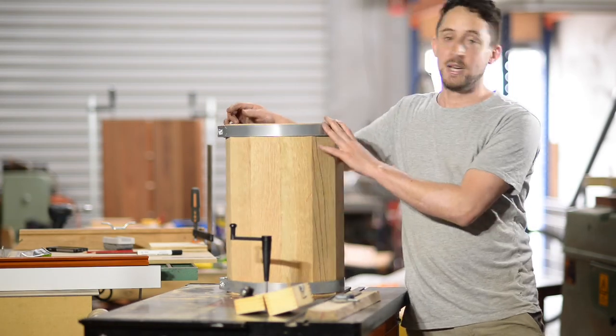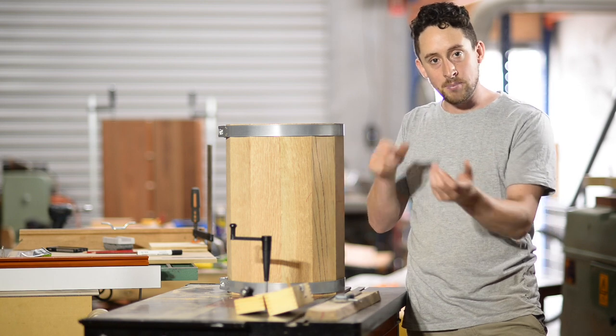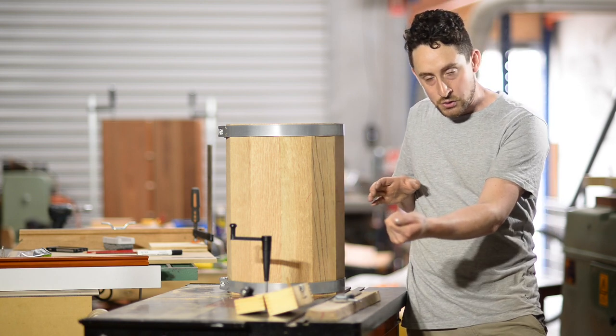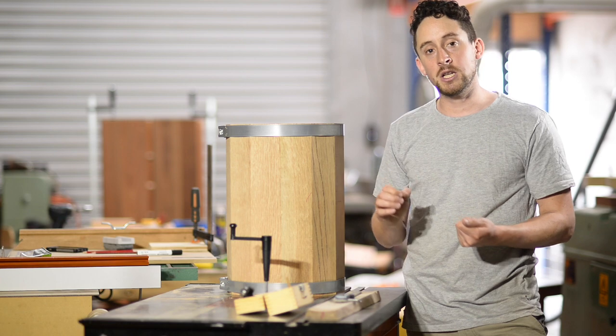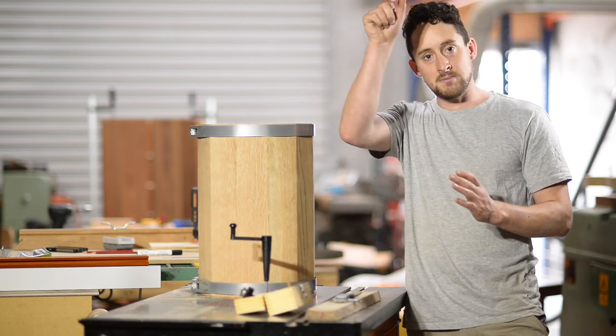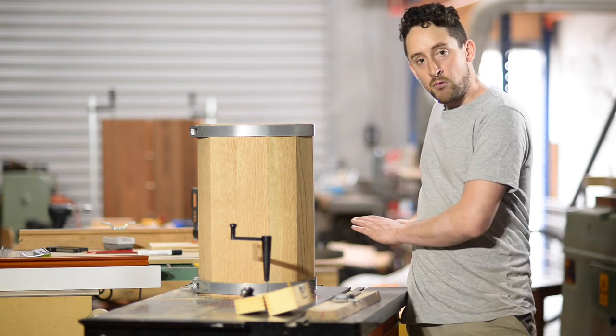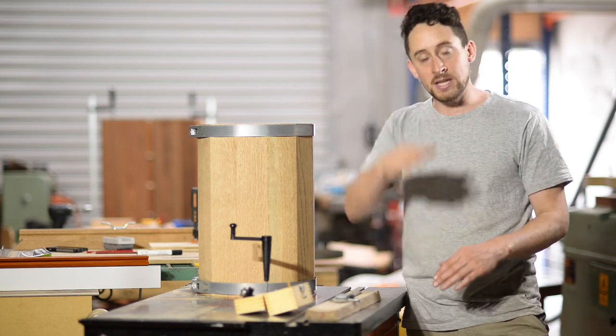So say there's a gap between A and B — take A out, get your hand plane, get it nice and sharp, put the stave in the vise and try to just reshape that chamfer really gently. Another way is to put a piece of masking tape or a couple of layers on one side of that stave and run it over the chamfer bit again to correct the angle.